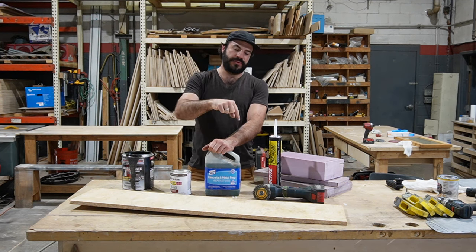The top layer of this flooring assembly, and this is another one that might be controversial, is going to be this. And this is Advantech OSB engineered subfloor. And I know a lot of people think that OSB is garbage, and I'm with them, but if you've ever been around this Advantech product, you'd know that this is nothing like normal OSB. It's significantly denser. I believe this stuff is around 80 pounds a sheet, where normal 3/4 inch tongue and groove OSB is gonna be around 60 pounds a sheet.